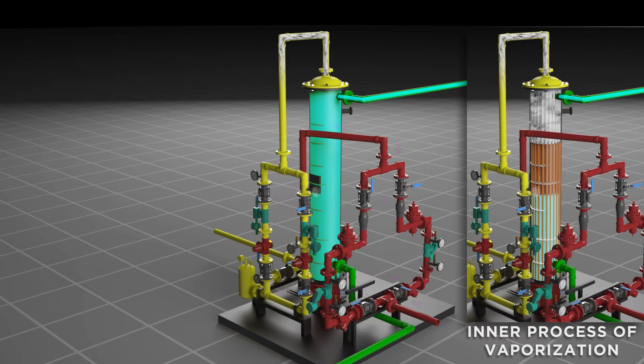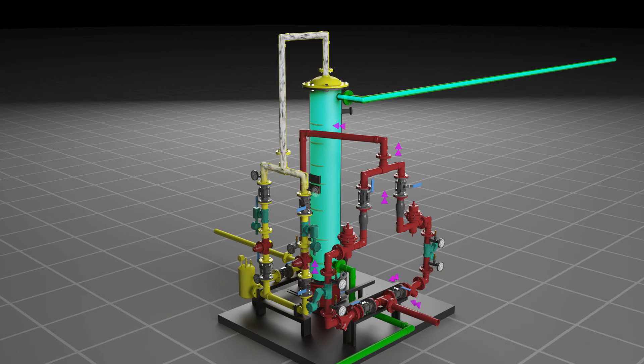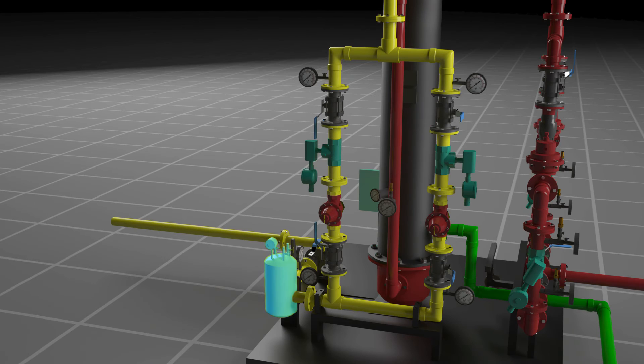This converted vapor LPG passes through an inbuilt pressure regulating station consisting of regulators. The HLV has a dual standby system, meaning there is a backup for every critical component. Further, vapor LPG passes through a heavy hydrocarbon trap, which ensures 100% vapor LPG, and then through secondary pipelines and a secondary regulating station to the consumption point.